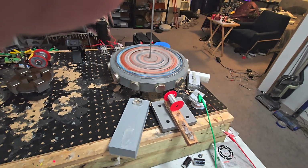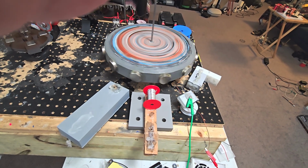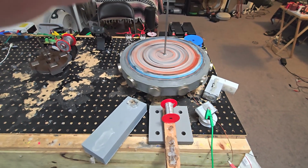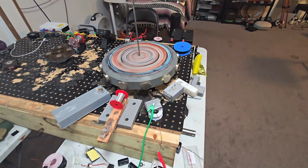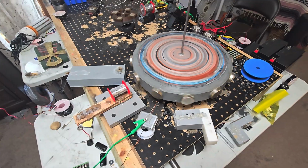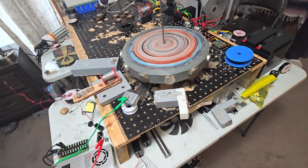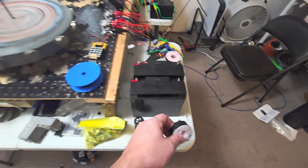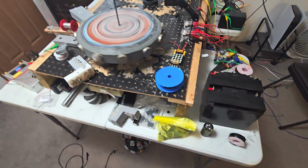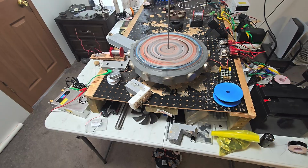If I can't find a good use for it, I'm going to make a 12 coil rotor motor. Use this rotor. So 11.4 ohms, a 32 gauge. It's a very tiny coil. It's got to be close to the smallest one I've ever made with these dimensions. I've made 50 turns around something like this before. It's a really small coil too. So yeah, it's slow to pick up. It doesn't get going really fast.